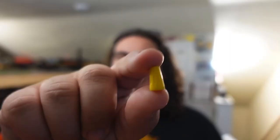Yeah, it was awesome. So, with these locomotives, always follow your wires. Check for loose connections or any of these pesky little wire nuts. Get rid of these. Just solder it, you know. I think Lionel put those wire nuts in there so you could easily interchange parts. Like if the Chuff switch went out, you just tear it out, put a new one in, and just wire tie it back together. It's probably done to save time behind the soldering iron and save on materials instead of soldering.